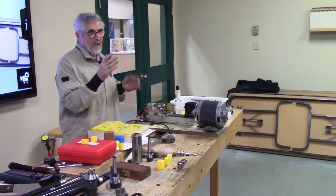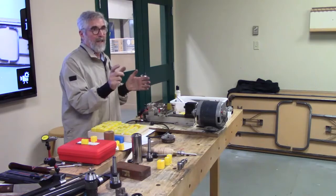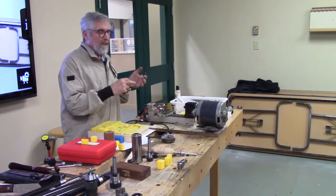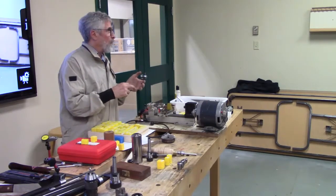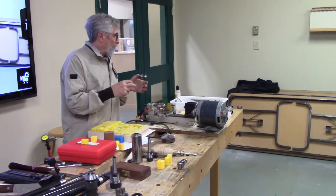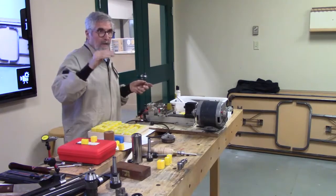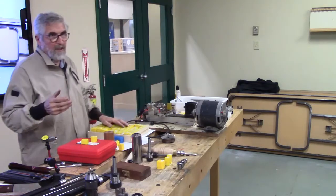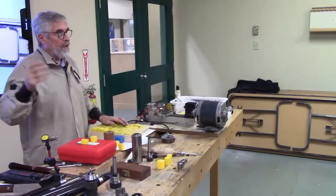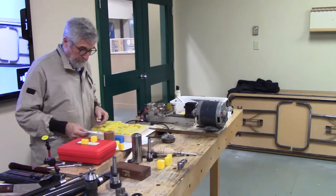And so every different pen size that you have, you could have one of those little mandrels. I'd want to do it in steel for the 7 millimeter one, because I don't think aluminum would stand up. But certainly 3/8 manages okay, and all the ones up above. So 3/8, 10 millimeters, 25/64s, all the way up. You could have one of those pen mandrels set up for it.